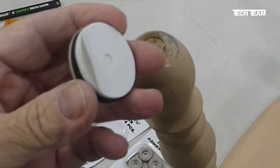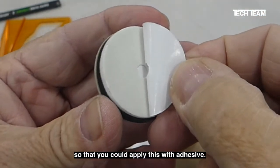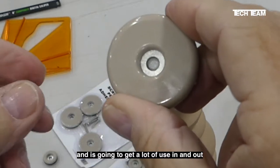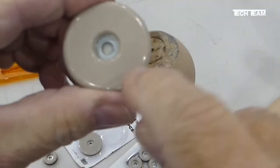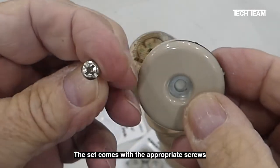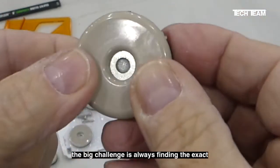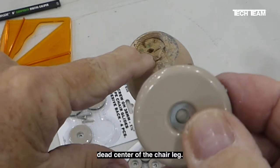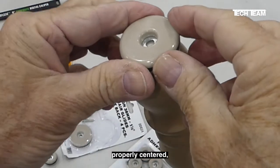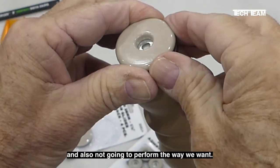TechTeam number 824, 823, and 826 glides have an adhesive backing so you could apply them with adhesive, but for this particular application — since a kitchen or dining room chair like this is going to get a lot of use going in and out — what you really want to do is use the screw-on method of attaching it. The set comes with appropriate Phillips head screws; you could use a number 2 Phillips screwdriver and just screw it into place. However, the big challenge is always finding the exact dead center of the chair leg, because if we can't identify the exact center, we're going to have a fitting that won't look good and won't perform the way we want.